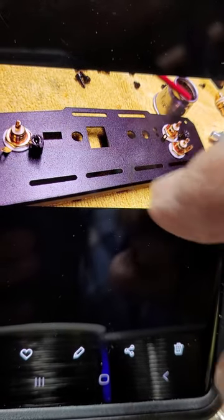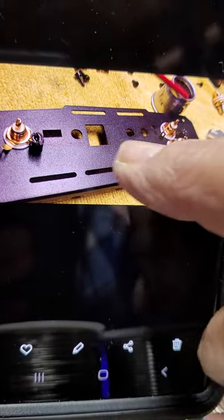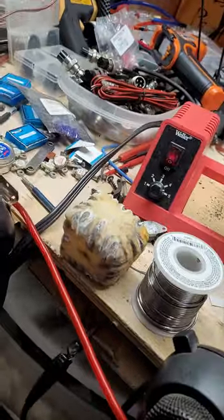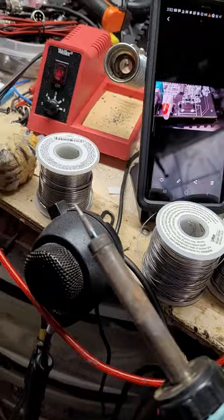I took that end plate out, and you see this is where I put the new panel mount chassis mount in the plate. That's where the left and right go. That's ground on the bottom, that's hot on the bottom RCA, that's ground on the top, and that's hot on the top. Under the board here, if you take an iron - which I think this is still turned on - with the sharp tip, the pencil tip. This is a 35 watt iron with a pencil tip.